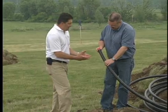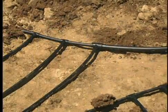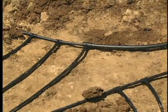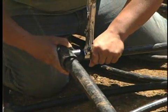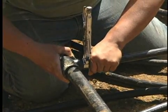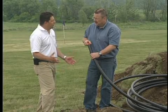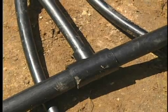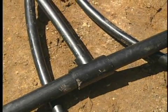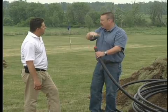The other great thing about it is it has the ability to be fusion welded. What that means is we take all these other loops and we actually tee that into the two pipes that go into the house — almost like a manifold. We fusion weld those pipes together, which means it all becomes one piece, and there are no mechanical fittings that can have a potential leak possibility down the road. So really an excellent, reliable system. Since you melted the piping and fused it together, it all became one continuous loop.